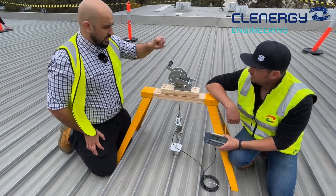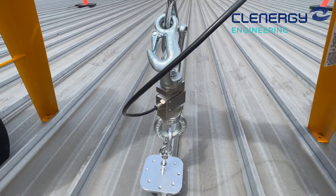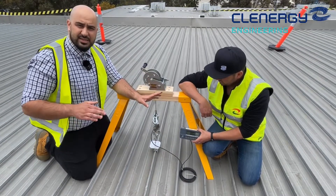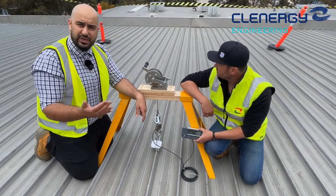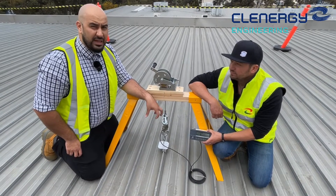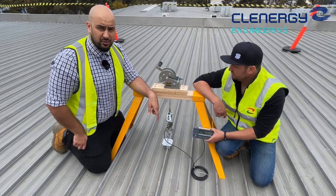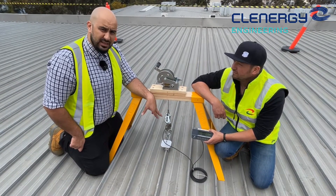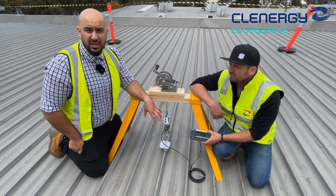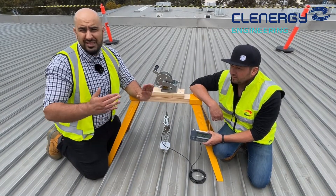We're going to be winching this up, which will add some pressure onto the clamp. The reading will tell us how much pressure is between these sections, so it's important to note that we need a consistent value between the three readings. The maximum we should be going up to is about 2.2 kilonewtons to make sure there's no significant failure happening to the roof sheet. If a failure occurs before 2.2 kilonewtons, the next two tests on this section shouldn't go past the point at which it failed on the first test — so hypothetically if you get a failure at 1.5, the next test should be within 10% of that 1.5.